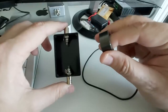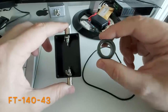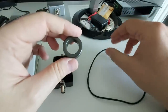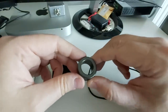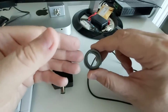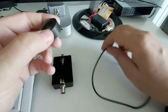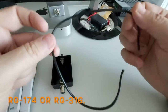Power-wise, some people say it will take 100 watts, but I would say 70 watts is the maximum I would use. You could also use an FT-140-43, but that requires a different number of turns. On the FT-114-31 we're going to wind six turns of coax. On the FT-140-43 — which I also use for 49:1 or 64:1 transformers — you would use eight turns for the lower bands (80 to 20 meters) or seven turns for the higher bands (30 to 10 meters). By turns I mean turns of coax, like the RG-174 I'm using here — about 15 inches or 40 centimeters. You could also use RG-316.